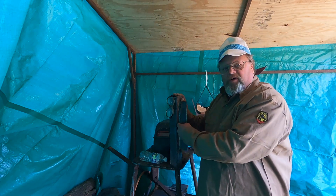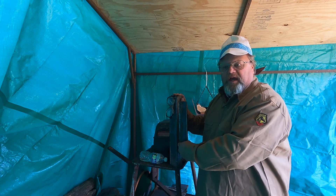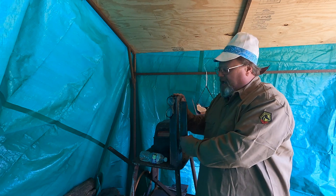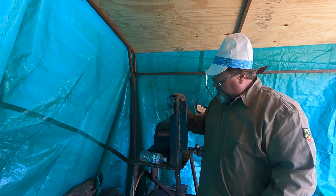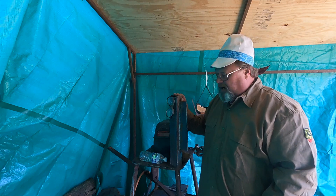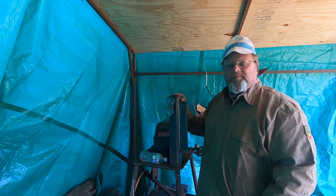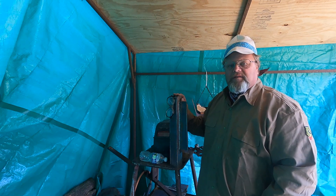When you're welding, you start above the weld, come down to the bottom of the area that you ground down, and work your way up into that area. You're going to have to watch your heat — you don't want to get it too hot, you don't want a big giant keyhole, but you want to see that you are penetrating that area.